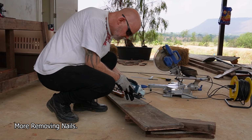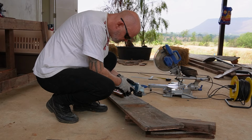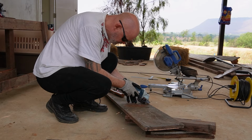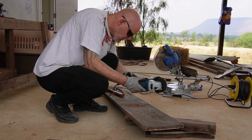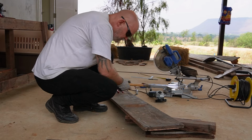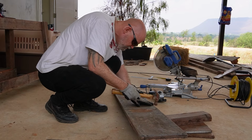Sometimes you hit the nail trying to drive it back through the wood and it just bends. One technique I found worked most of the time was to cut the nail a lot shorter with an angle grinder before trying to drive it out of the wood. Then use a pair of pincers to grab the small shard of nail to remove it. Most of the time this worked on the difficult cases.